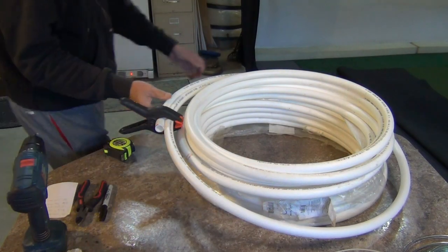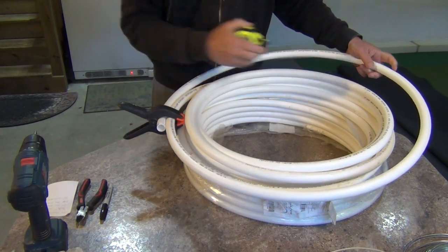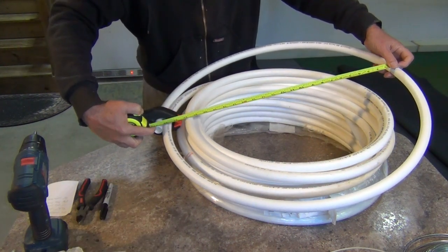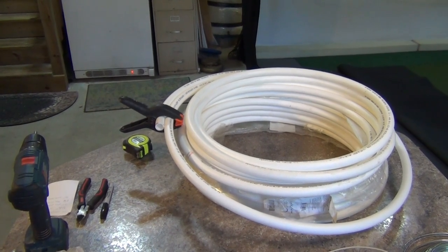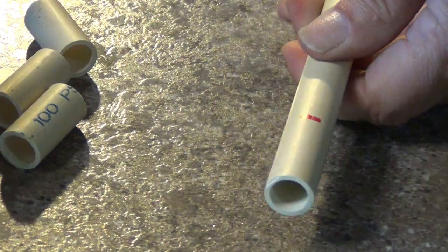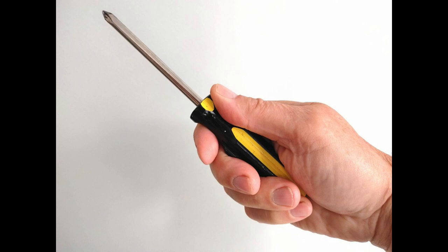To build the stacked hoop antenna I'm going to take the original design and modify it a bit. Once again I'll be using three-quarter inch PEX tube to form the antenna. A lot of people have suggested using a hula hoop instead — if you can find a couple that will work, go ahead and use them. Use your imagination; as long as you follow the basic designs I'm showing you, it will probably work out fine. Remember you are building two identical antennas, so do all the following steps twice and build them at the same time. For clarity I will be showing work mostly on one antenna, but will be making two of them.